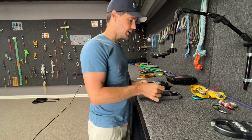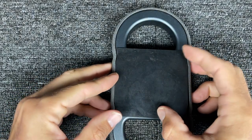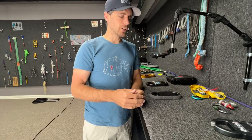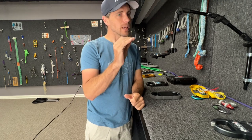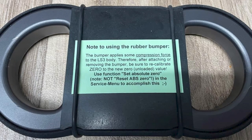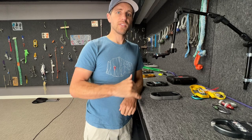Another way to protect the screen is to take this rubber piece and place it right in there like a glove, then take two rubber bands and wrap it around on both sides — it'll stay in place. Now, if you take a rubber band to this, you're squeezing it ever so slightly, and that's all it takes to throw it off a little bit. But you can set relative zero once it's on there and then you're good to go. Relative zero is basically the hack to use this thing.